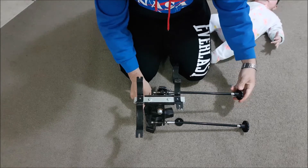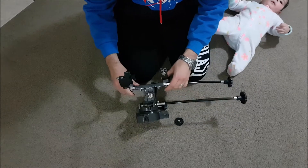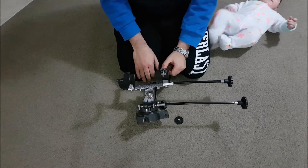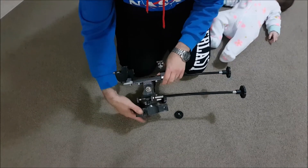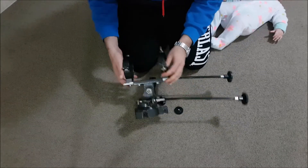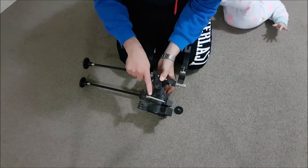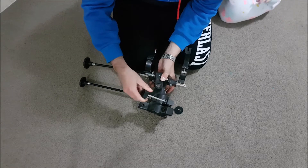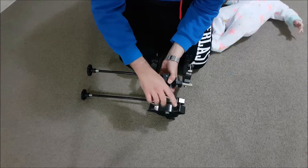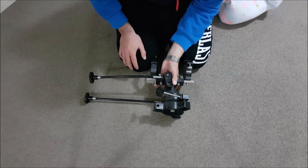After applying a little bit of force on the slow-motion controllers, I actually get a little bit of movement on both azimuth and altitude. What I'm struggling to do is coarse-rotate the azimuth axis and coarse-rotate the altitude. The instructions just say you move it, but when I try and apply any pressure it doesn't move at all. So I think I'll just start taking it apart and slowly clean out the rust. I've also noticed there's this tensioning knob here — I have no idea what it does when I turn it; the actual axle is stuck. I think it's to allow for coarse azimuth adjustment, and then you tighten it and use the control knob for fine tuning. I'll just take it apart bit by bit and see if we can make any progress on it.